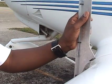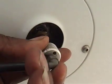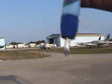That doesn't mean the tank has no fuel at all — we have to manually check it. This is the actual fuel dipstick that tells you how many gallons are in the tank. You can see the numbers on the side — those are gallons. You rest it on the wing here; this part goes into the slot. When you press it up, fuel flows up into it. This is telling me we actually have 18 gallons in this tank. Any debris? No. Any bubbles? No. Coloration is blue and it looks fine — the fuel is good in that wing.